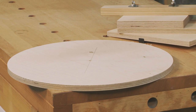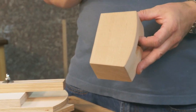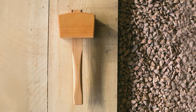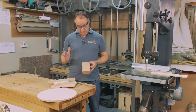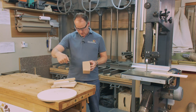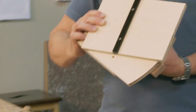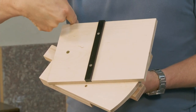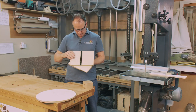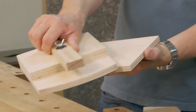Cutting a circle is fairly straightforward, but what we have here is a mallet that my students make as one of their test projects. We have a curve on here which we could cut as a freehand curve, but actually we've got a jig we've made up where the pivot point is back over here. We've got a baseboard of plywood; this is a screw going through that creates our pivot point. We've got some HDPE which fits into our mitre slot, and the top section rotates on that centre point.